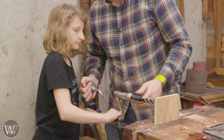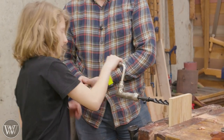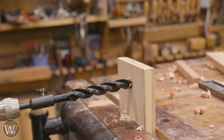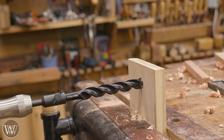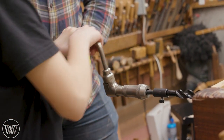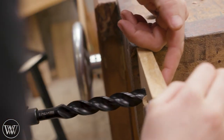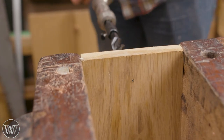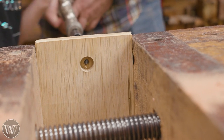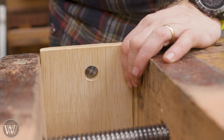Back on the base, we need to drill a hole for the vertical to go into. It's a three-quarter by three-quarter inch square vertical, so we're going to start with a three-quarter inch auger. This is too much work for her to hold and turn, so I'm going to hold it in place and let her turn. We ran into a problem where the snail on the end was starting to split the board — it's a wedge. So we had to put it in the vise so the vise will keep the board together while we drill it out. If you're ever drilling close to the edge and find you're splitting it, put it in the vise and that will hold it together. We're going to go until the snail pokes out the other side, turn the board around, and come from the other side — that way we'll get a really nice clean entry and exit hole.